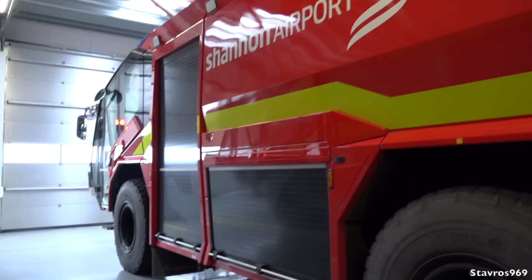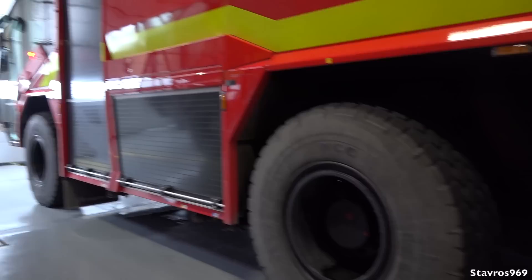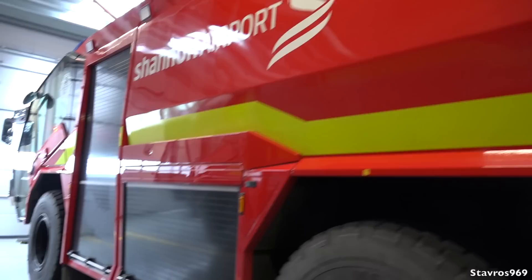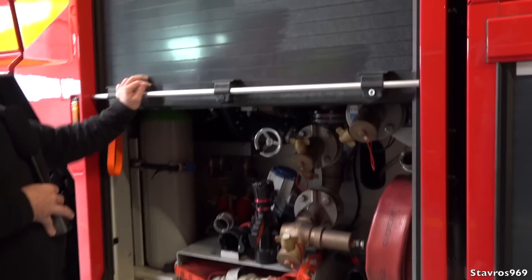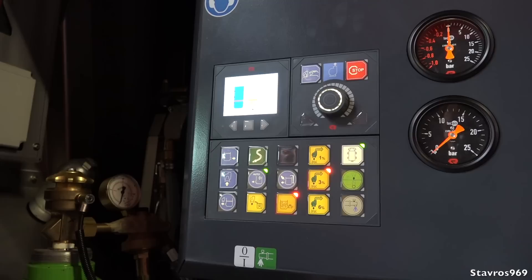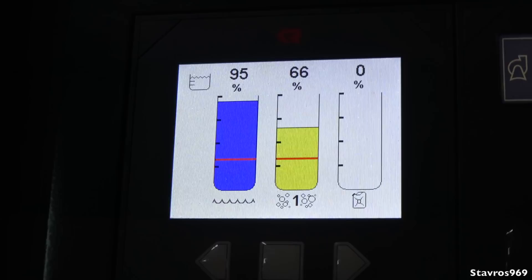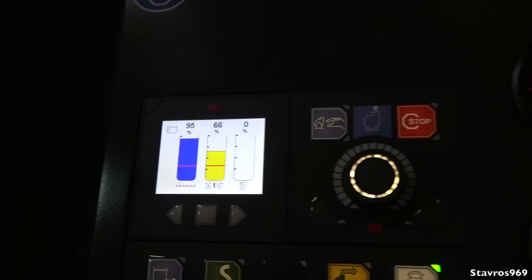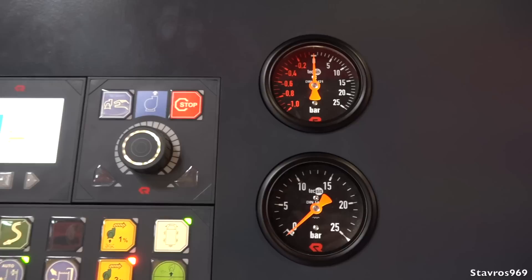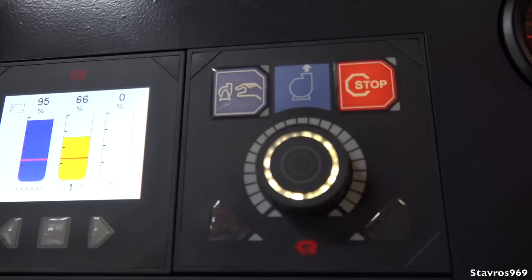You can be stood outside the fire engine and know the levels inside just by looking at the lights. We also have all the LED lamps that light up really bright. James is opening up the doors now. Inside you'll see monitors to track levels of water, foam, and powder. The blue indicator is your water levels, the yellow is your foam levels, and the other shows the percentage of foam being used — normally three, six, or nine percent depending on the fire. When the pump is engaged it immediately goes to 10 bar pressure. Blue buttons are for water, yellow buttons are for foam.